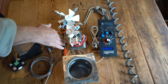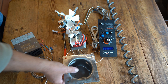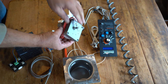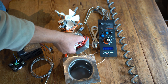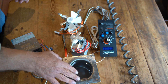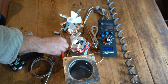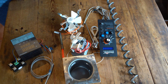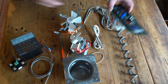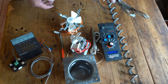These four items here came in a kit as one. We've got the stainless steel burn pot, we've got the drive which will drive the auger, we've got the fan that will force the air into the auger burning pot, and we have one igniter. Now the other item is this timed controller for the auger, and that came with a thermostat and two meat probes.